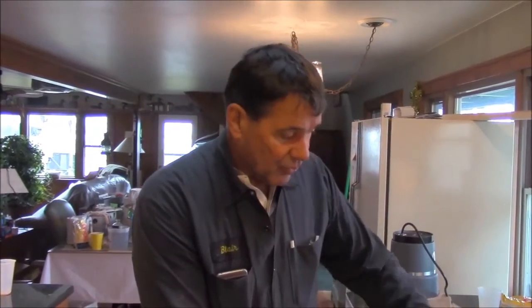This unit is also hooked in line with my main hot water tank. My hot water tank feeds water down here, and when this is about to run out — if I'm using more than 4 gallons — it's being replenished with hot water. So it'll be kind of invisible; you'll never know when you're running out of hot water. By the time it uses 4 gallons, my hot water tank upstairs has supplied it with hot water and I will never run out.